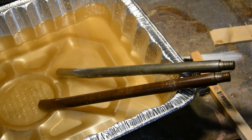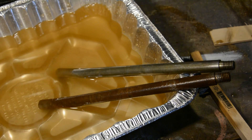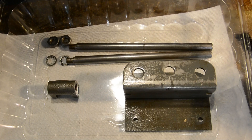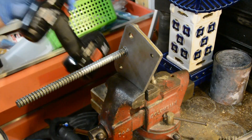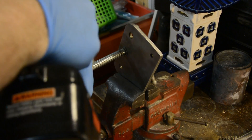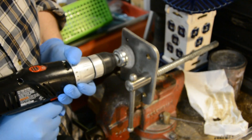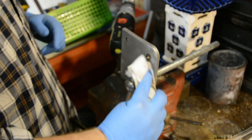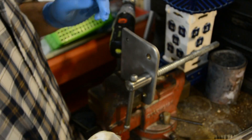This is the part where I got absolutely shocked — I had no idea that vinegar was going to work this well. Look at the one that's scrubbed versus the one that's not. It's absolutely ridiculous. Here are most of the pieces after being scrubbed. You can see some of them still have some paint on them, and we'll have to take that off — and that means power tools. Having made sure the whole piece was nice and clean using my wire wheel attachment for my drill, I then wiped the entire piece down with WD-40 Specialist Rust Release Penetrant Spray. By the way, they're not a sponsor — just an amazing line of products you should have in your workshop.